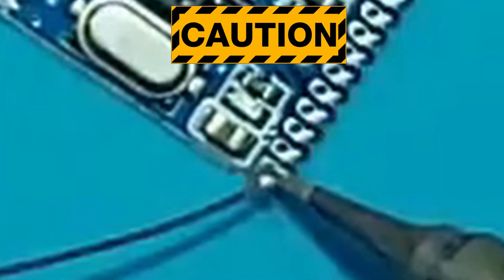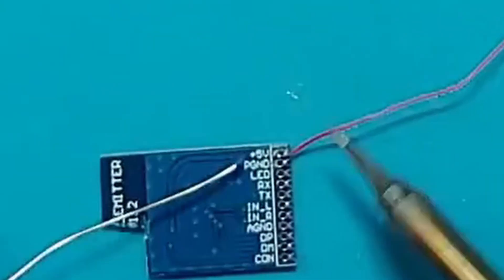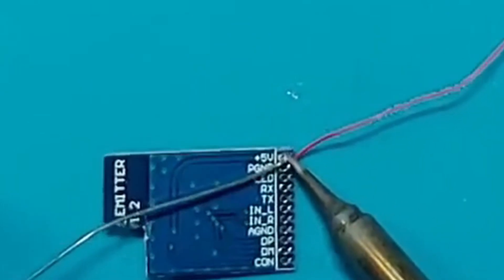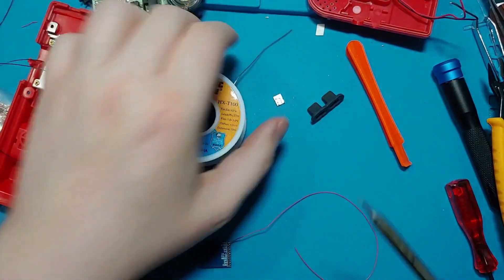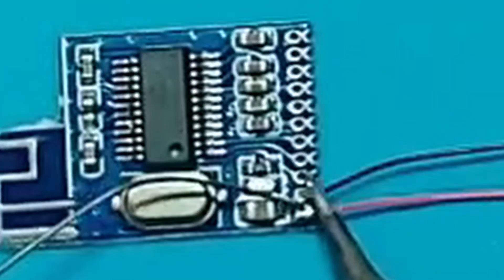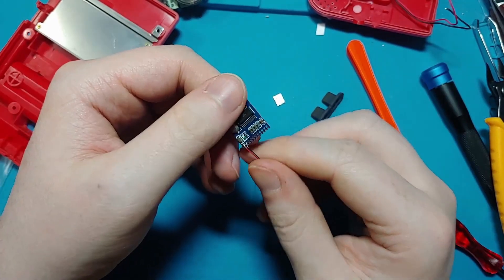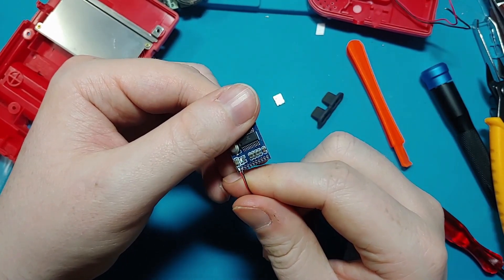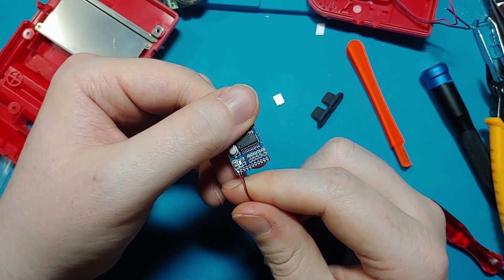Future Tanner here — pretending like this is a terrible idea. There's a hole, use it. I cut out about five minutes of me just trying to get rid of this solder that I just tinned on here. Terrible idea. All right, we've got power. Now at this point, you should really check if these are connected or not with your multimeter, just beep it out and see if it beeps. If it does beep, then you've got a problem, obviously.